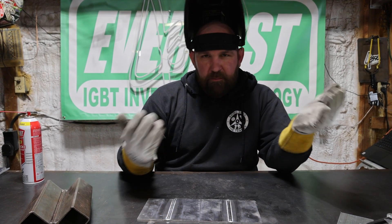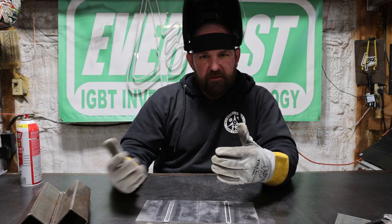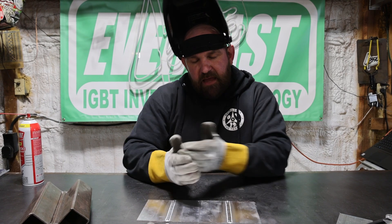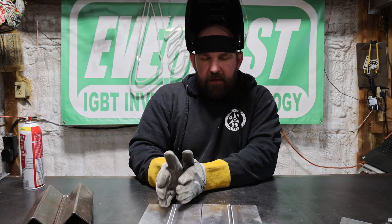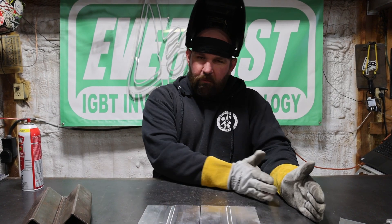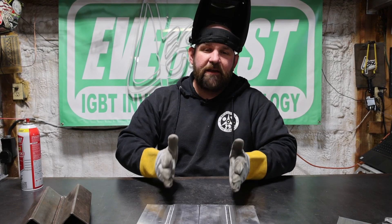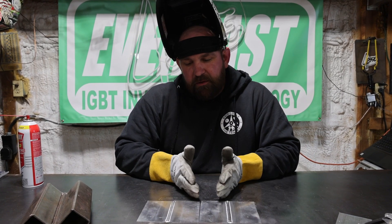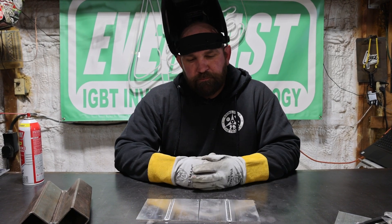It's the welder — not the welder, it's the welder. Finding a setting in the middle — like 30–35% balance, 120 to 160 Hz — and then finding the matching gas flow for your cup, that's what's important. Play with that, tweak from there, find what works for you. There's no one right setting, and if you copy someone's settings without copying their technique, you won't copy their results. Now that we've pickled that cucumber — I'm Jesse McCullum with Everlast Welders. Remember: weld mean, weld green.